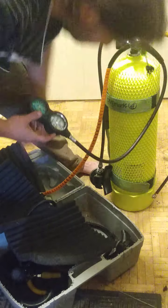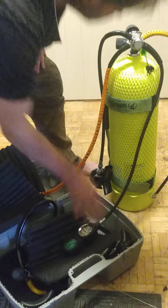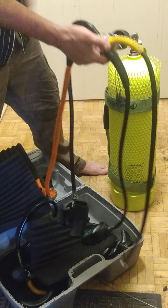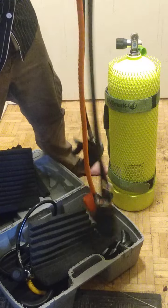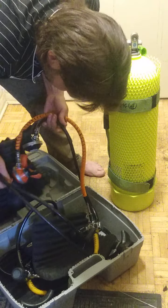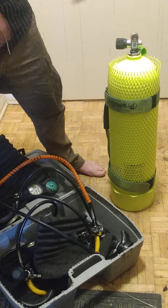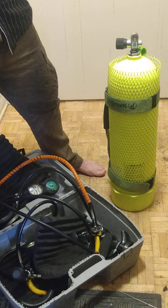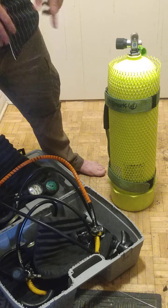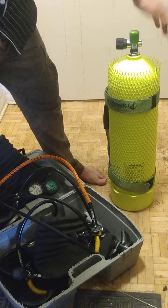They both are Sherwood Blizzard of different years. This is a really good setup all the way around. And so that is the end of a quick overview of the diving gear. You now know how to depressurize the system. Once you have depressurized the system, you are safe to remove it. That is how you install and check your system — that's after you've had it checked out, when you know it works and you're just going to check it to make sure. Whenever you get new dive gear, you do this thoroughly. Check everything out — make sure every feature works and is smooth operation. If anything is a problem whatsoever and you hear any leaking of any kind, you don't want that. This is 3,000 PSI, which means when it leaks you will hear it — it will be a noticeable thing. When you're done, put the cap back on and your tank is ready for storage.